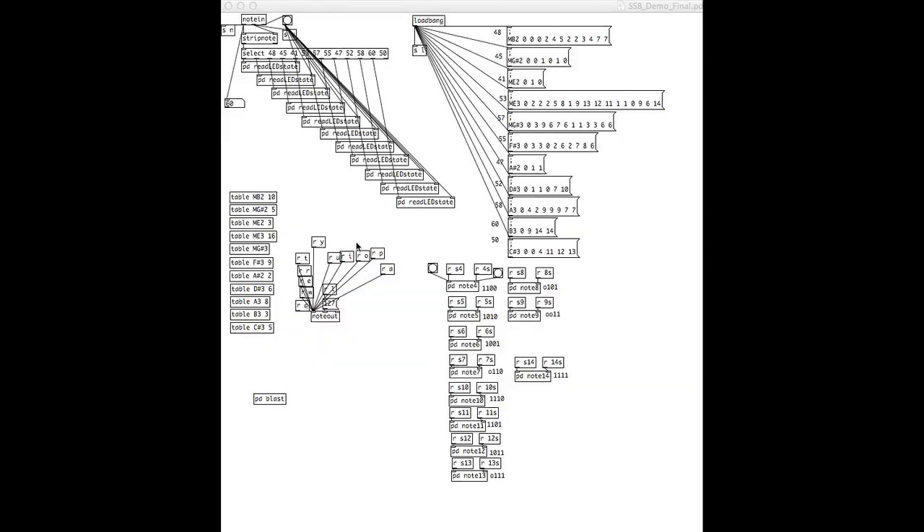This is the patch right here to run the DIY flame organ and synchronize it to the Star-Spangled Banner. Basically, when a MIDI note comes in, it decides which MIDI note has just been played, goes down to the table, reads what it's supposed to do, and then outputs to the Brain V1 a certain pattern of LEDs — or in this case, we're actually triggering relays.